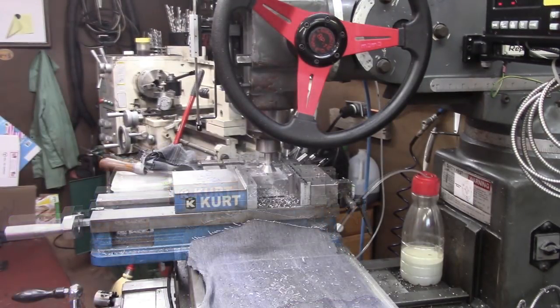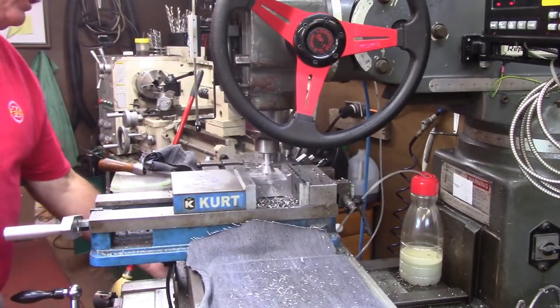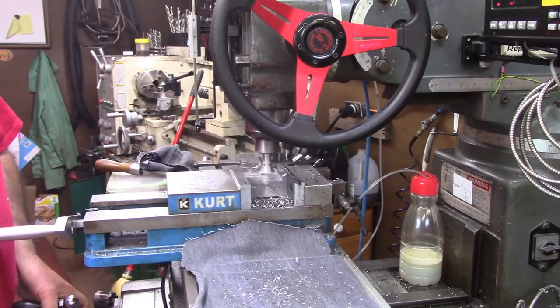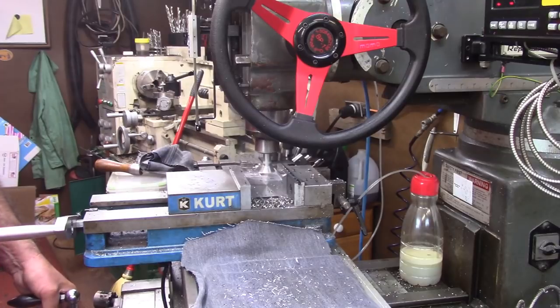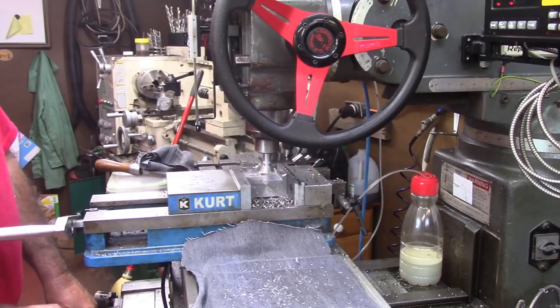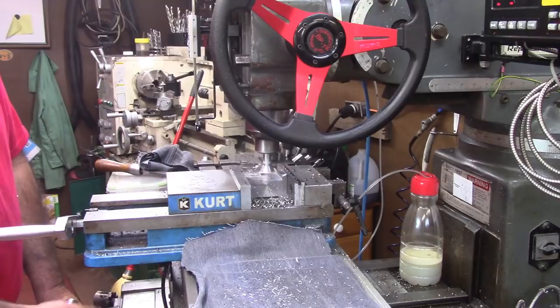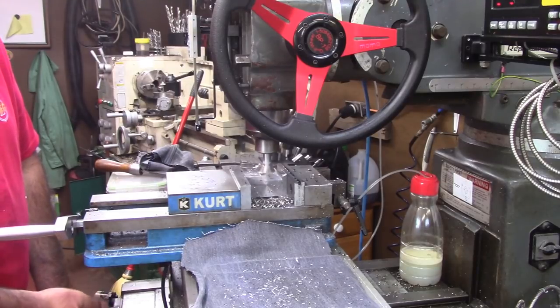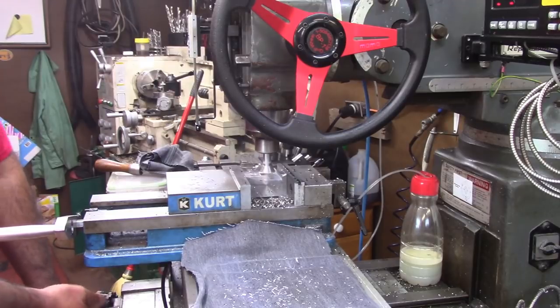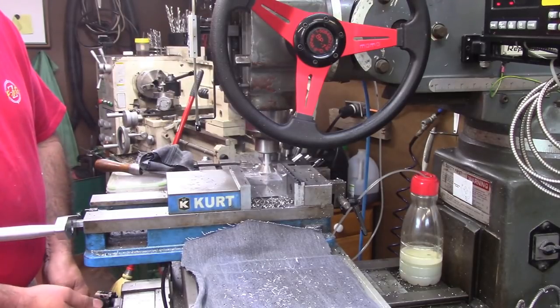One thing I like to do, and what I'm doing, is I try to do conventional milling, and I try to be consistently patient. So I'm going about 30 thousandths a pass with the mill, dovetail cut. Now it'll probably take more, and I'm a bit conservative.